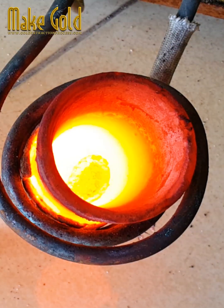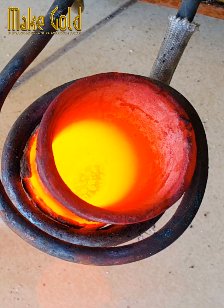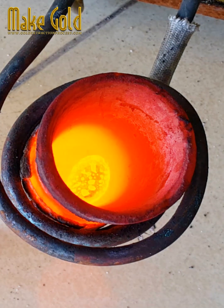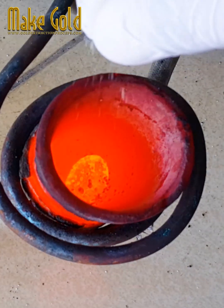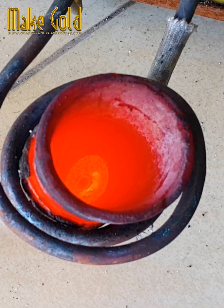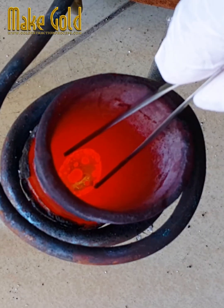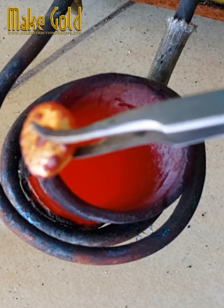A small flame or spark is used to locally melt the end of the gold wire to form a spherical ball roughly twice the diameter of the wire. The spherical ball is thermosonically welded to a metalized pad on the semiconductor. A wire loop is developed as the bonding capillary moves across to the contact pad of the circuit board or device package. The wire is then welded thermosonically to the metalized pad of the device package, and cut using the sharp edge on the tool, with its length allowed to protrude to form the subsequent ball.